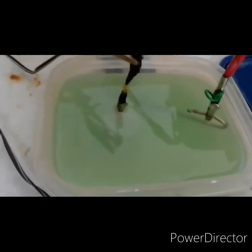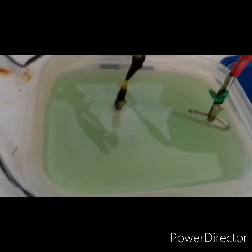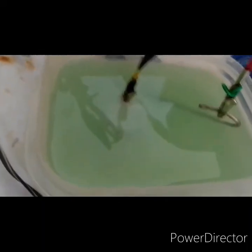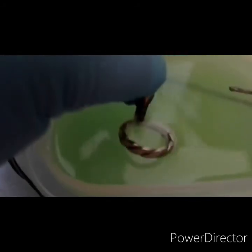The acid is ten percent, and salt, and I put in a little natron — but only a tip of a knife. The durability is better — I found out when I polish it. In case it gets a little flat spots, I polish over and it's really, really durable. I'll show you that on some one cent and two cent pieces which I nickel plated.